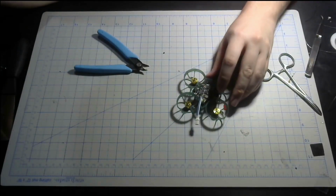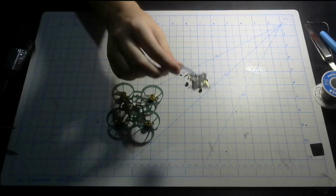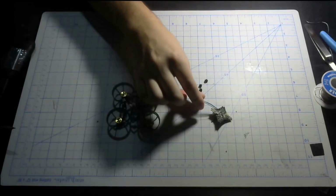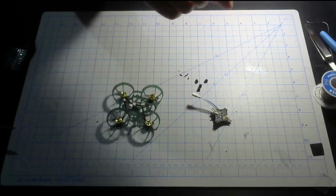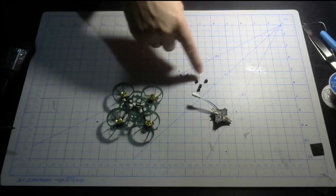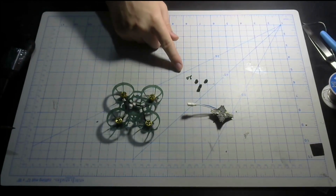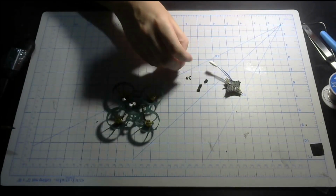Alright, now we got the VTX all wired up nice and clean. Anyway, next we're going to be installing the flight controller into the frame. Now, unfortunately, this flight controller comes with screws and grommets specifically for HD, which are really darn long, so it's not really ideal for analog. So that's why I'm going to be using these grommets and screws instead, which you can buy on tinywhoop.com, link in the description.